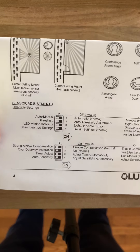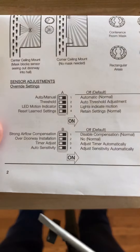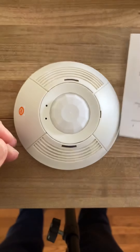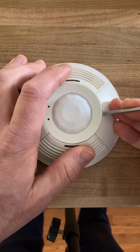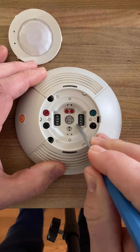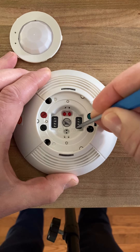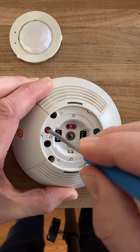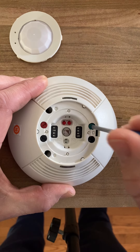These are the instructions that come with the sensor, and we're going to show you the ones that I'm most common with out in the field. So if we want to adjust the sensitivity of the sensor — for example, if lights are not shutting off in a space — we have to turn this little dip switch on, and that's going to allow us to do that. We have our passive infrared, which we can adjust over here, and we have our ultrasonic that we can adjust over here. So that's one adjustment that you may need to make.